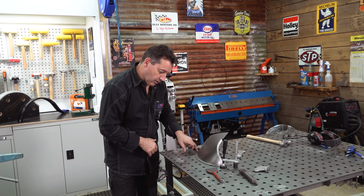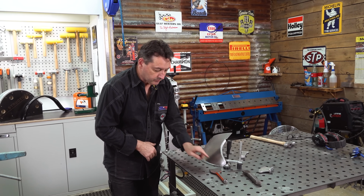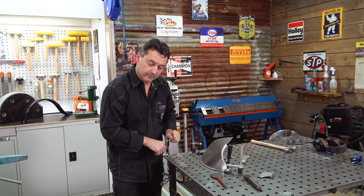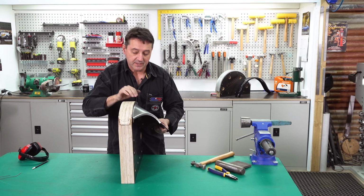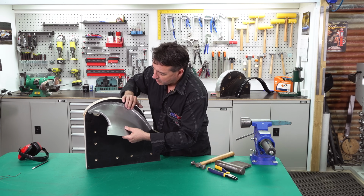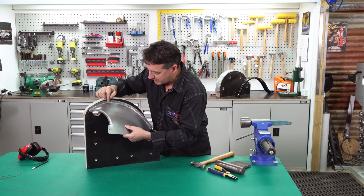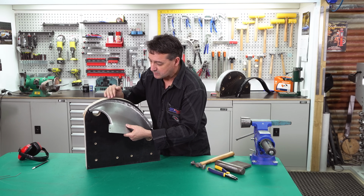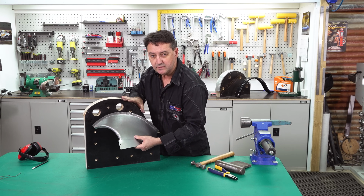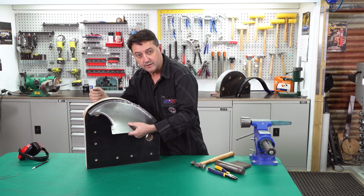We've now caulked that line and we've got that flange nice and flat, but it would have thrown out a radius. So we need to release it, trial fit it back on the forming buck just to check. I've now got the vertical flange fitting the face of the forming buck. However, it's undone some of our previous work. What it's done is shrink this flange. So we'll need to stretch again until this fits. It's a process of repeating caulking, stretching until we get everything to fit with the radius, because we'll bring the guard in and they have to fit together.